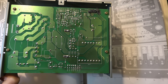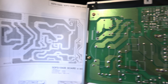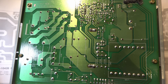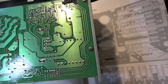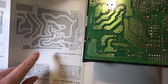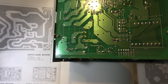Looking at one of the two main PCBs in the power supply — this board here is called SOSP-1042-D if you look at it upside down. And the one in the schematic for the PAL machine is 1042-B. I've got this upside down so that it's the same way round as the schematic. So you've got the connector there for mains in, connector there which goes down to the other board inside. I've got them the same way round, and you can see a lot of it is very similar between this schematic and the PCB layout here — the three lines down here, same connector positions, and this big inductor here — but it's clearly not the same PCB.